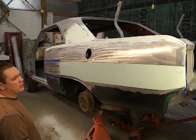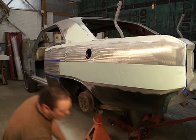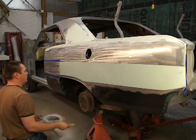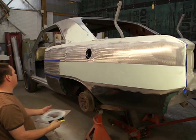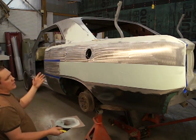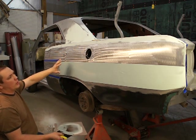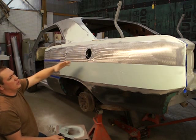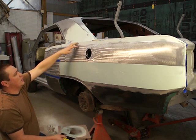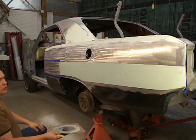What I'm going to do next is re-tape that section right there and then finish. I'll go ahead and clean this off — it's a lot of wet. I'll re-tape this line for a little bit there, finish that section off, and then I'll sand it and show you. You don't want a low spot in these lines, but if there is, I'll be able to show you guys what you've got to do. You have to have this line and this line good and true before you mud this section. I'll show you more of that later.